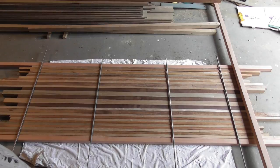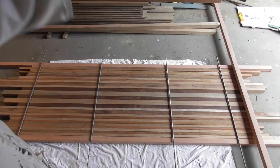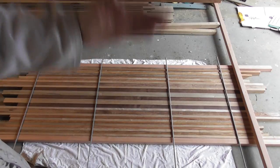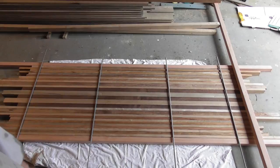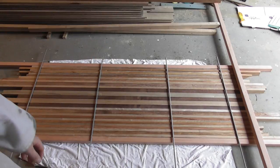Even though it is pretty thick, the stuff I'm going to use, I want to stack them on edge. So I'm going to build a quick jig out of some timber, and I will slot all the pieces of timber in and glue them as I go. But I also have to, unfortunately, because I'm putting these steel rods through, drill holes through every board 4 times.